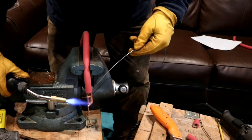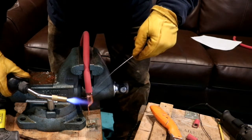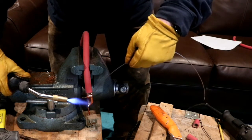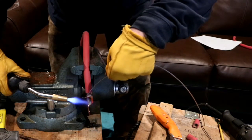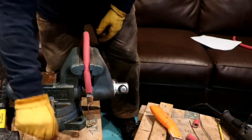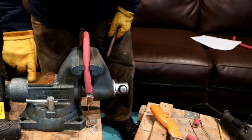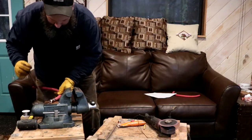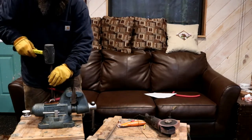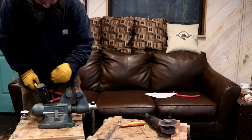All I'm doing is heating up the copper cap, and then once it gets to temperature, I start melting the solder. I've got it hanging upside down so gravity does the work, feeding the solder down in there and coating all the wires. Then all we're going to do is use a punch — any kind of hammer will work — and put it on something flat. I've got this little anvil part of the vise. And there you have it.